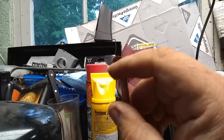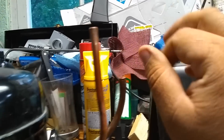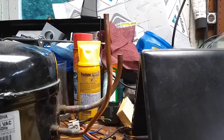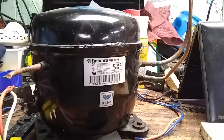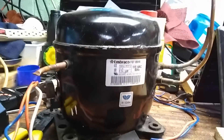I hear it running. There's air coming out on this one, and on this one is the vacuum — I can feel it draw in a vacuum. Now I have this little Schrader valve from China that's going to go on here, and I'm just going to solder that in place. I'll take out this little valve stem with the valve stem removal tool, then solder that piece of pipe into place, clean the copper real good, heat it up with the torch and melt some solder in there. I'll probably leave the Schrader out on this — it won't normally be needed. It's just going to be a vacuum port that hooks to the hose on my gauges.